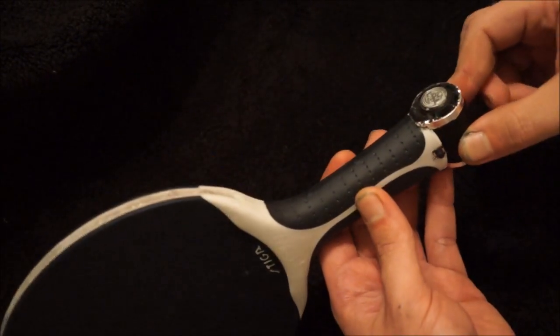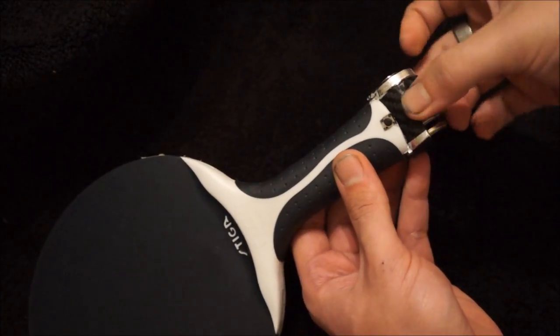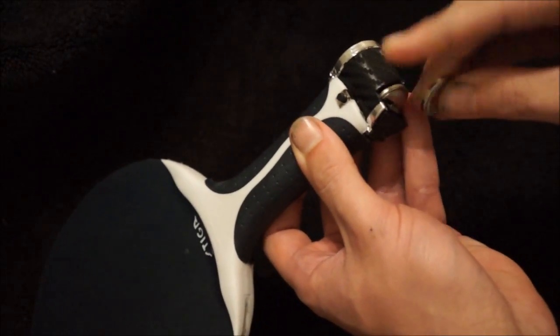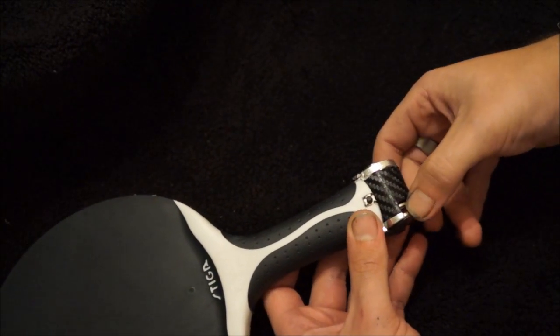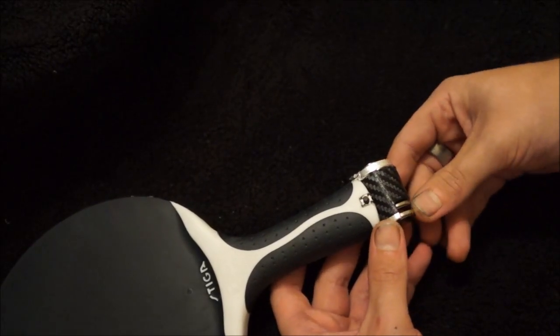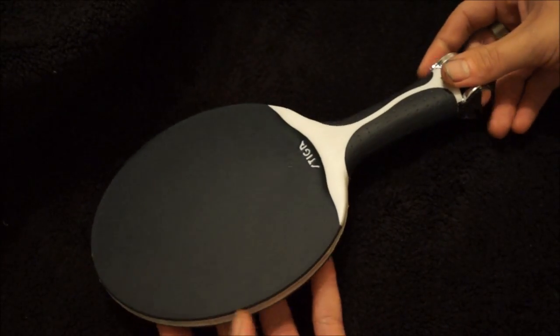And then the other thing I added, obviously, I moved the switch down here, and then I put this big tube down here, which actually just holds the speaker, and this acts as a resonance chamber because it's hollow, and then there's two CR2032s that sit down here in the bottom. Now, the 32s, they hold out pretty well. You can get through a game or two with them, but it does hoover up some battery power pretty well, but it's a lot better than having, you know, AAs or AAAs swinging off the bottom of a ping pong paddle. And so with that, that is the official birth of Darth Paddle.